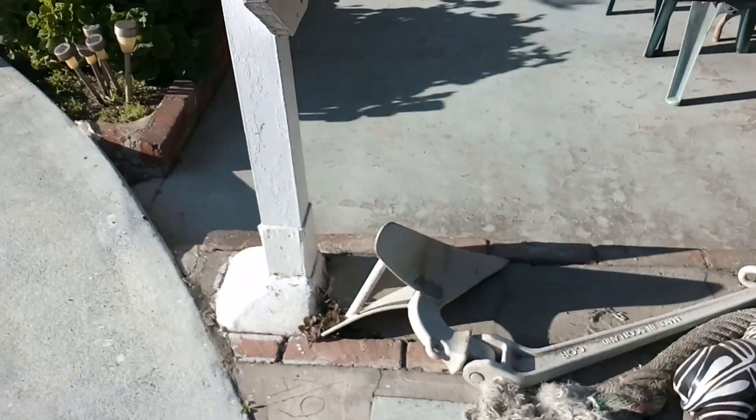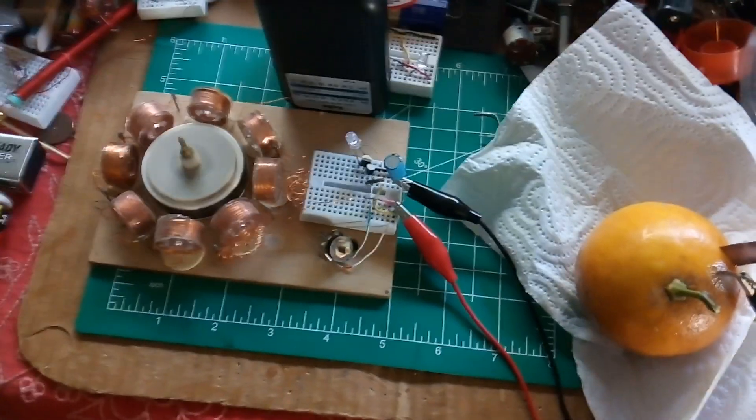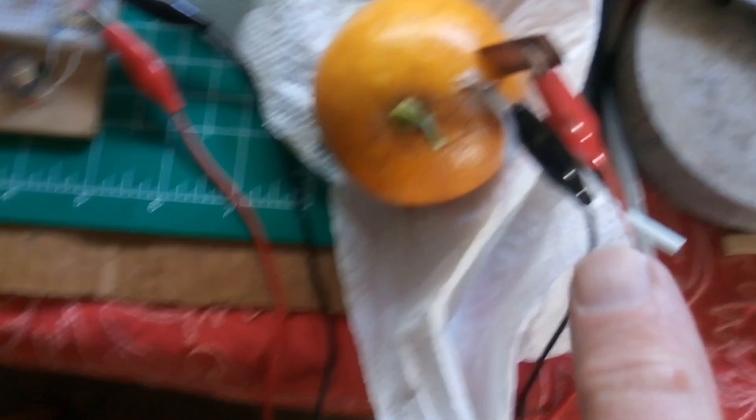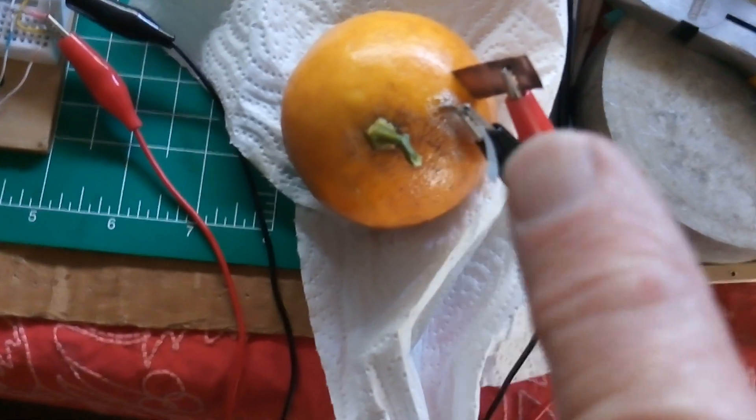Anyway, that's just something I wanted to share — the prospect of starting a citrus fruit battery while the citrus fruit was growing and then just seeing how long it would run. I don't think it's going to run a long time. What happens is the electrolyte neutralizes and builds up corrosion deposits on the magnesium, and the thing slowly slows down and stops. But at least it's running long enough to do this video.